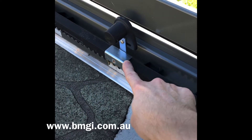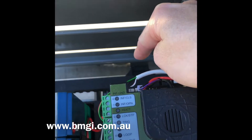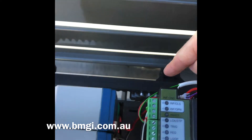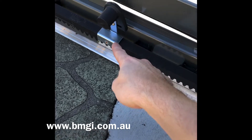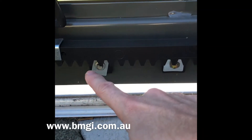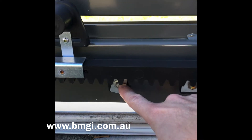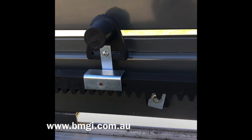You will also need to install the magnet marker. That measurement is 600mm, measured from the centre of the pinion gear to the closed end. If you happen to put the marker on and it's in the place of the lugs and you can't quite do it, just move it to the left or to the right and then secure.